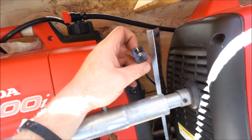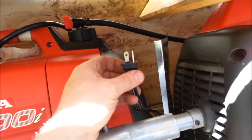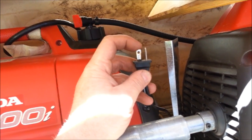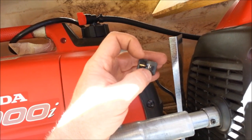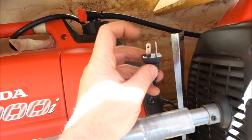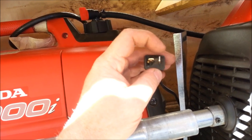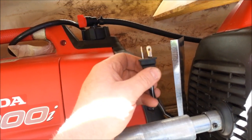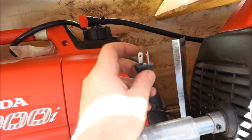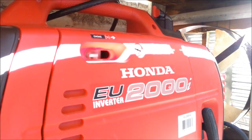If you need to make a 12-volt plug for your generator, all you do is take a regular outlet plug, heat up one terminal with a torch, and while it's hot use needle-nose pliers to twist it — it'll remelt the plastic and sit. That's how you make a Honda plug. You can do the same thing with a Yamaha plug, which is just two angled ones. Sometimes if you have a plug with a wider side you might have to grind it a little bit. The fan works great — as soon as it starts, the fan kicks on.